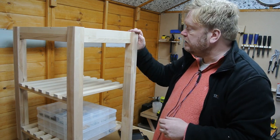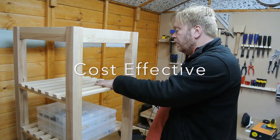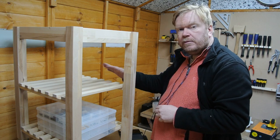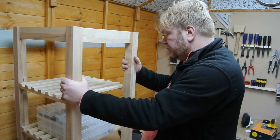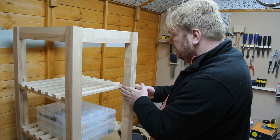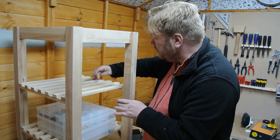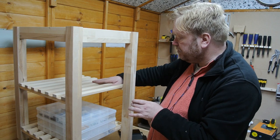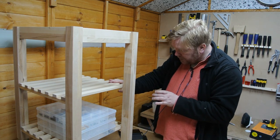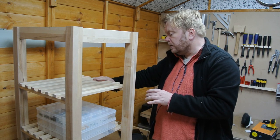You just can't get the materials to the point whereby making this from scratch seems convenient. I'll need to reduce the width of the shelves, and to be perfectly honest, I'm not sure how I'm going to do that. The shelves themselves provide quite a lot of the rigidity in the actual frame itself. My guess is that as I'm essentially reducing the width by more than the width of the end piece here, I can afford to lose quite a bit of material off the shelf before this really starts to be much of a problem, and then maybe just prise these out — they appear to be glued and pinned, so maybe I can get a chisel in and knock that about a bit.